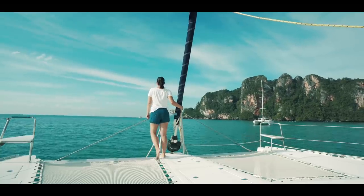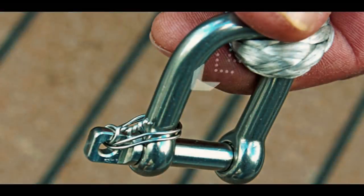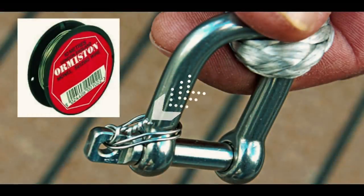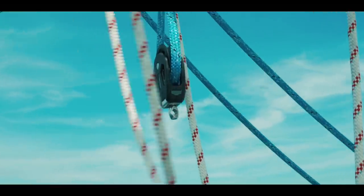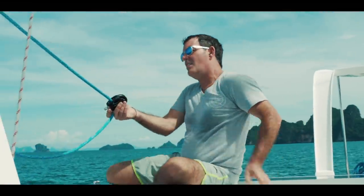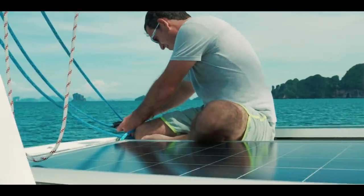The only issue is we have a little bit of maintenance to do. For those of you who watch our regular episodes, you will know that one of the things I like to see on a boat are seized shackles. This is using a Monel wire to run through the eye of the shackle pin — it stops them from unfastening at inconvenient times. Please do not use zip ties unless you are absolutely in an emergency, as the UV will degrade them in under a couple of weeks. Our shackles weren't seized and so we ended up with a block working its way loose, causing a problem with the mainsheet system.